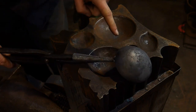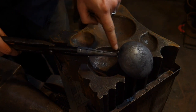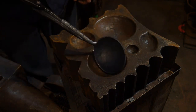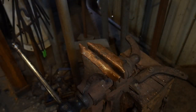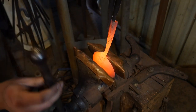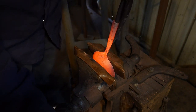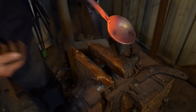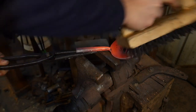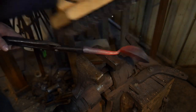So we've got that all done. Through forming like this, you're going to see it's a little off-center — just a little bit crooked, and the seam isn't quite running straight. I'm going to heat this up, grip the dish portion in the vise, and just tweak it over a little bit. The trick is you don't want to squash down your bowl — you just want to tighten it up just enough to hold the steel while you do your tweaking to get it straightened out. You don't want to create a flat spot — and that totally just happened on camera, you're welcome.